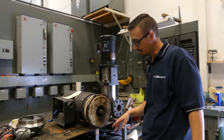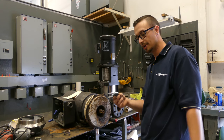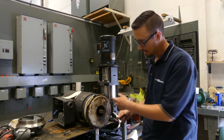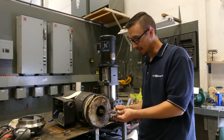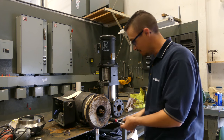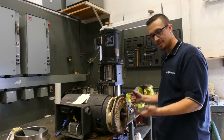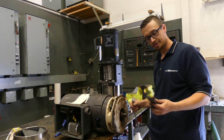Right now we're just going to try to get this seal out. I've got a small bearing puller here — I'm going to see if I can get on here and get the rest of the seal out, and we'll just take it one step at a time. We got the front pieces of the seal out; we just managed to dig them out using a screwdriver and a scraper.